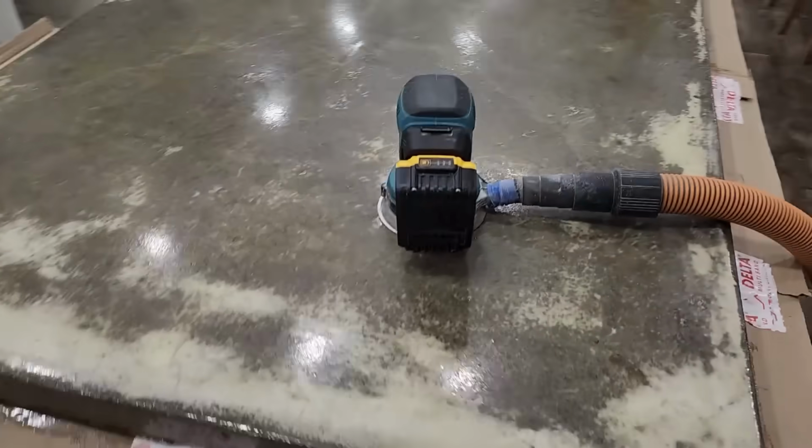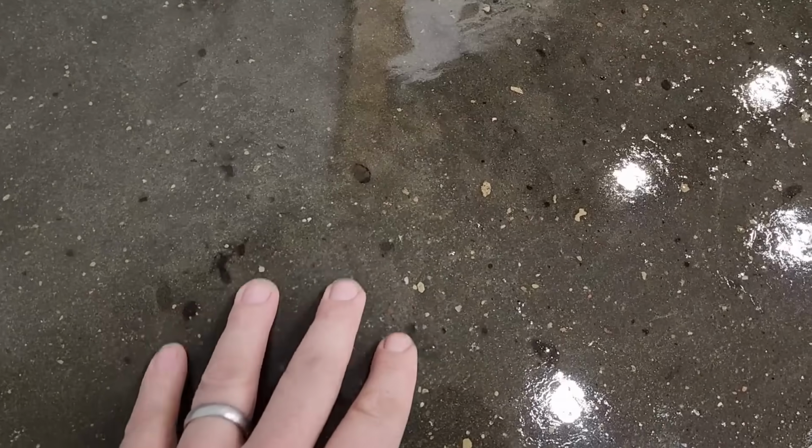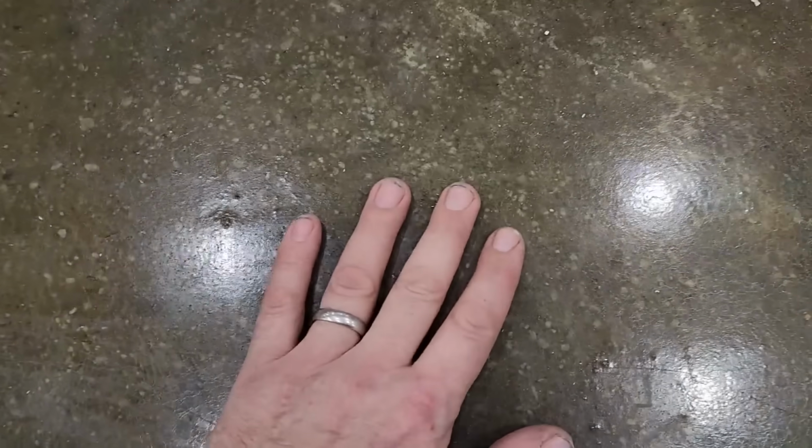This one, on the other hand, not so much. We like the white, we don't like the green, and we don't like the yellow. Main reason is I used the wrong epoxy. It didn't work out very well. And we should have just roughed up the countertop first, just expose a bit more aggregate. What we did here, we have a cleaner look with more exposed aggregate pieces. Gives it a nicer look. Then this one has ended up being very blurry.